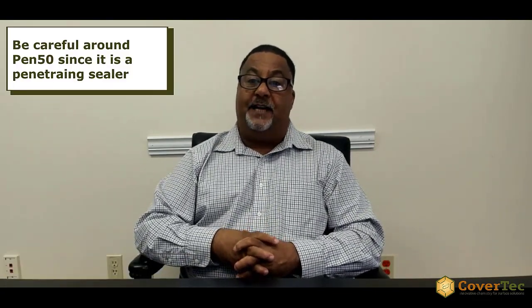So we need to be careful how we use the Pen 50 and how it reacts with other products. Remembering it's a penetrating sealer, its function is to soak into the surface. So any other sealer, any curing agent, bond breaker, all those have to be removed from the surface in order for the Pen 50 to penetrate. So if it's already being sealed, you're not going to be able to use the Pen 50 until you remove that sealer.